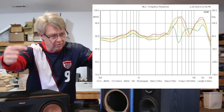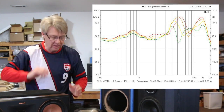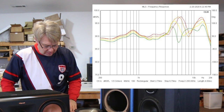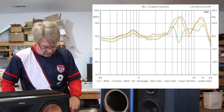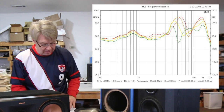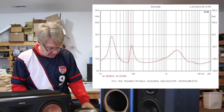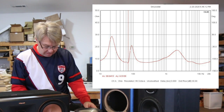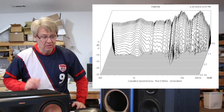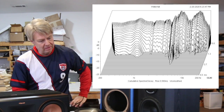The vertical off-axis didn't look too bad — that shows time alignment and phase between the drivers. These did stay in phase pretty well; as you moved up it started to lose some output at one of the peaks and smooth out slightly. In the impedance curve there's a resonance right near the port tuning around 68Hz. Looking at the spectral decay, there's some stored energy at the bottom of the tweeter's range — that would sound a little aggressive, a little hot, a little ringy.